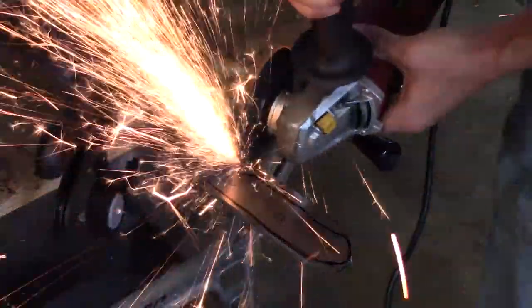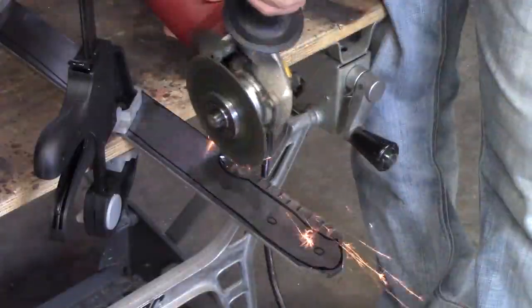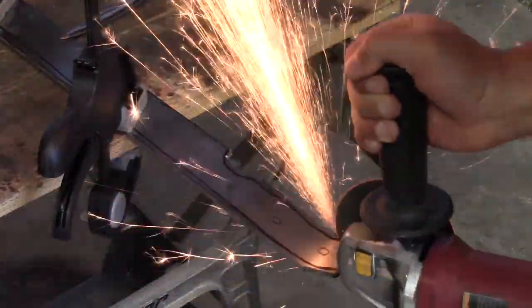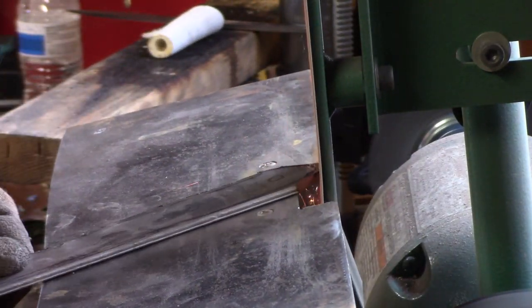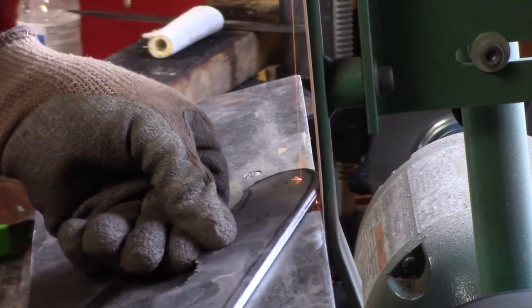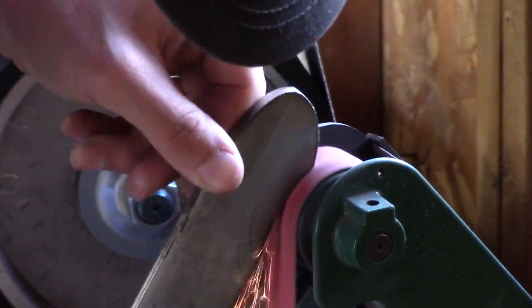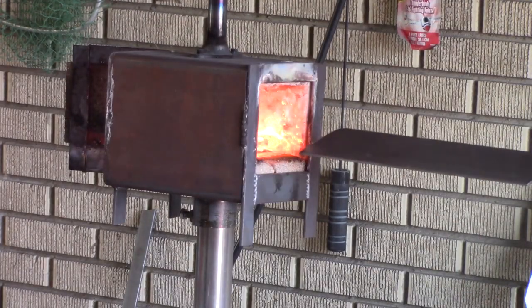So that would be a little too much to do in my forge. There's lots of reheating and eventually I'll get a bigger forge where I can make a knife this big. So I just drew up a shape and removed as much as I can with the angle grinder to get a basic shape that I can then take to the grinder and work out a little bit more. I go around all the edges trying to get to my marker lines, and I use a smaller 1x30 grinder to get any of the circular shapes — makes it a little bit easier.